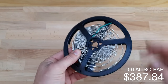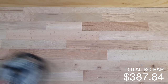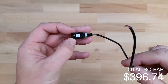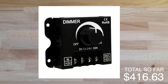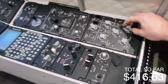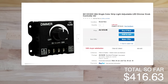I used one roll of 5m LED strip for $8.90. For flood lighting around the cockpit I used car number plate lights — 12V with two LEDs — 10 of them for $19.89. I also used three PWM LED dimmers to control the backlighting and flood lighting. I went with quality ones at $10.99 each on eBay, spending $32.97 on dimmers.